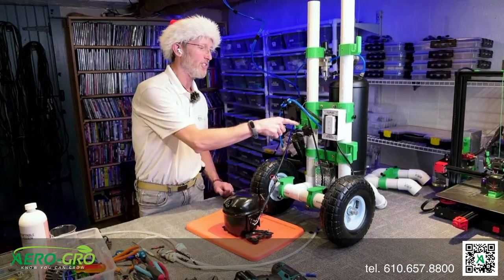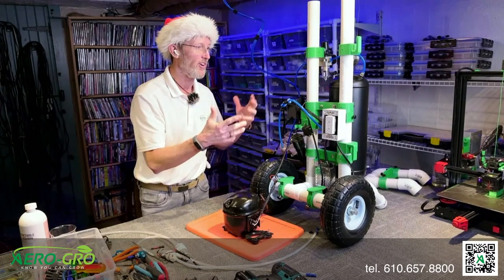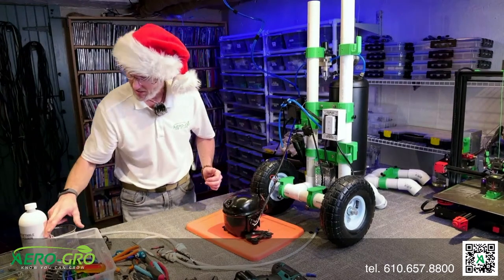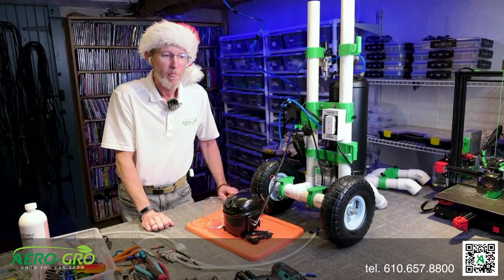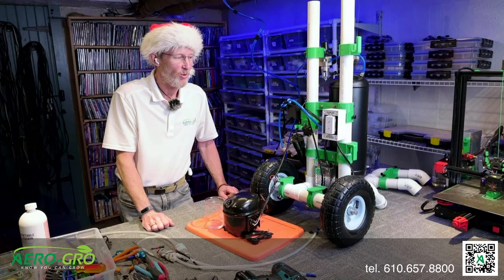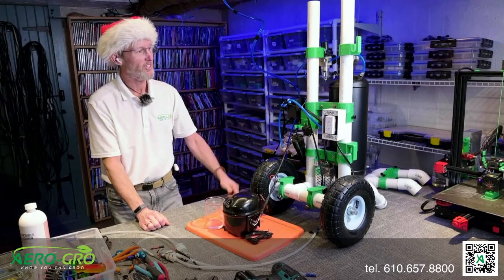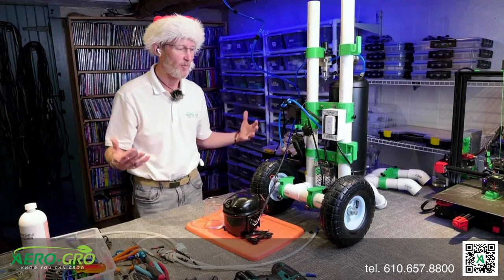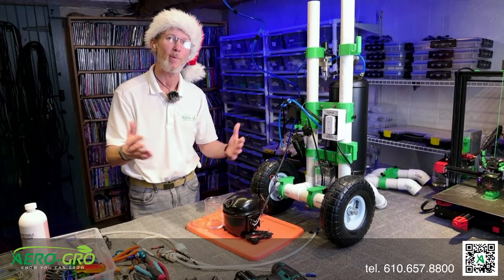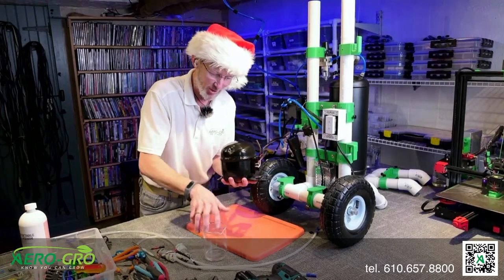Yeah, and again, the way these are designed with 3D printed parts with PETG, everything's snapped together, thumb screw together, super easy that way because you don't want a lot of extra hardware if you can avoid it. I always say, it's kind of a thing I like to say, the best designed part is the part you don't need, right? So, if you don't need it, chop it off. That's kind of the final step when you design something like this. You design it, you build it, it works great, but now you've got a bunch of extra stuff you really didn't need. You realize that in the end. So now you got to strip it back down. And that's what we have here, the stripped down version of lots and lots and lots of failed parts.